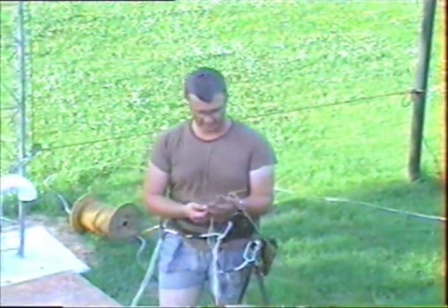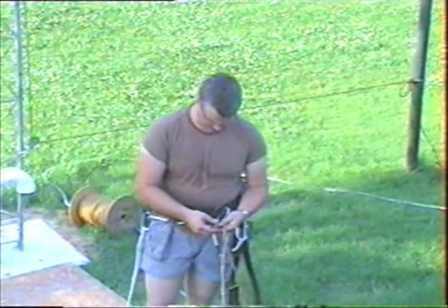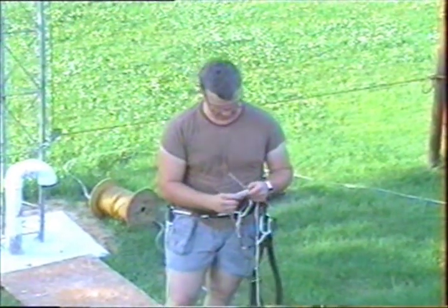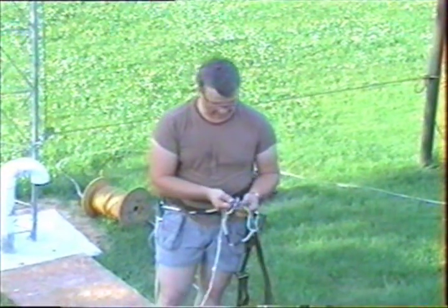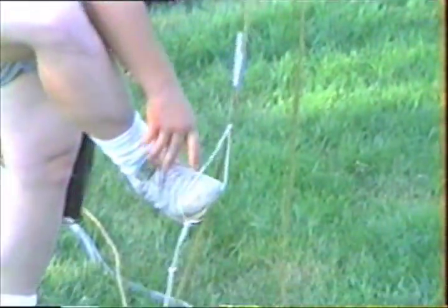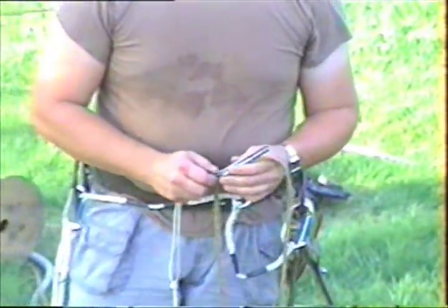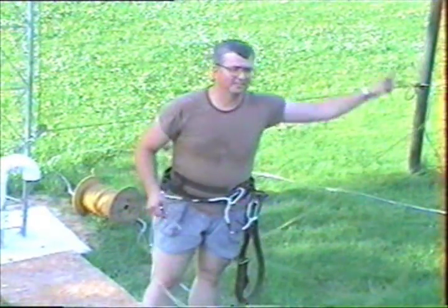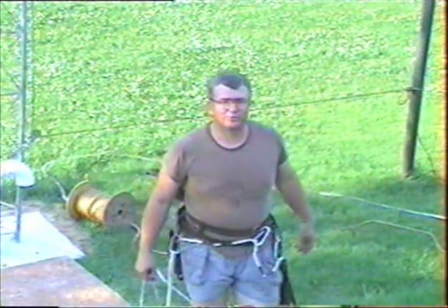Now I'm going to climb up and show you how I use this little mechanism to help me when I get up there to pull the tower further. I'll put this around the rope and slide it into position. As it's coming out of the bottom of the gin pole, I'll put my foot in there like that and push down on it — and that's what's going to raise the tower all the way up. Then after that, it's just like you had two or three guys helping you. It just takes time.